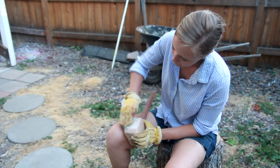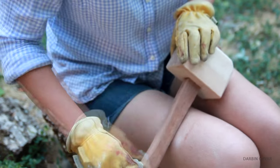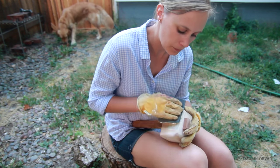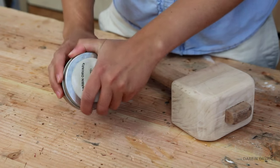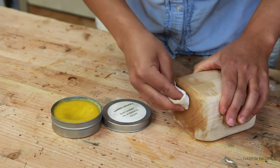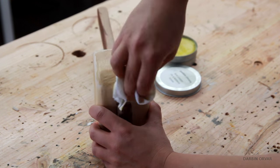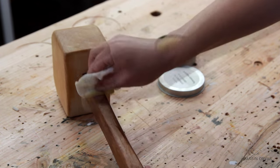Now finally sanding. I like to start with 60 grit, and then move up quite high to 220, 320, something like that. And only finishing left — I use my wax polish on all my mallets, which I really like because it protects and adds a very nice smooth feeling without becoming too slippery. For example, I wouldn't use shellac or polyurethane here because I don't want the mallet to fly out of my hand when using it. And the wax provides just the right finish.